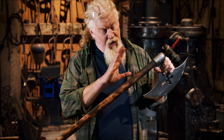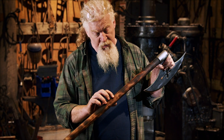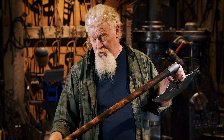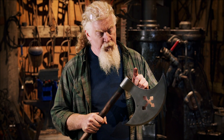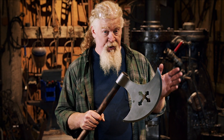You can see this has actually got some pretty striping in it. The black that you see on this is a burned surface that we then clean off. If you look into some of this wood, it's actually a nice tiger stripe maple. That's not too hard for us to source, so it's a pretty nice finished piece. We do wedge them, and we do pin them as well. We found that if they're only pinned, they can get a little bit loose and there's no way to tighten them up.